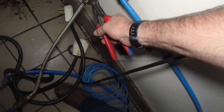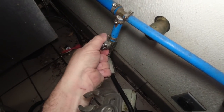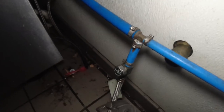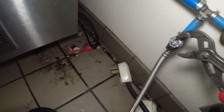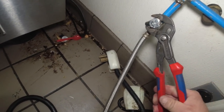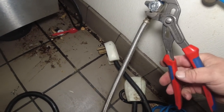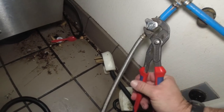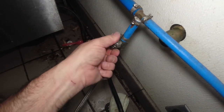I'm going to get started on this water valve — it does not want to turn, which really sucks because I can't shut everything off. That's a quarter turn valve and it's just not wanting to turn at all. It kind of gave a little something there... might have got it. There's a big chunk of calcium or something in it. Yeah, there we go — it must have been a chunk of calcium. Now it's working.